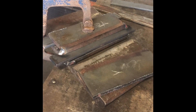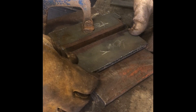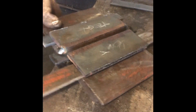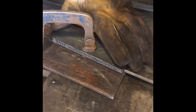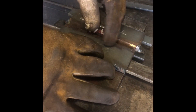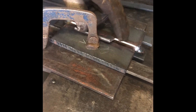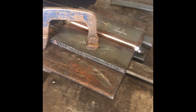Got it tacked down. So now we need a quarter-inch root opening. I'm going to put this one under here and shim it up enough to where it fits pretty level — I like it. I'm going to loosen this so I can clamp this side down a little better. Get it close, get it ready, get my quarter-inch gap tool there. That's about where I want it. I'm going to hold it, clamp it, check it again just to make sure I like it.